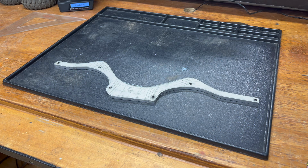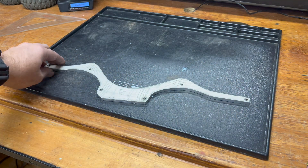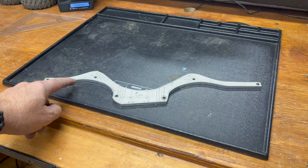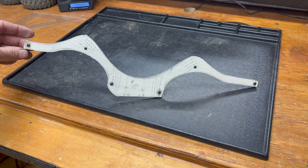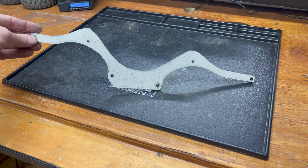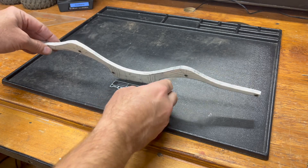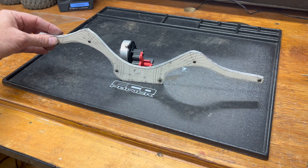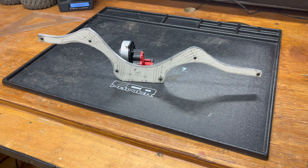The idea is to drill as few holes as possible — I went with six. I left the rail ends really over-long. It has a sort of photographic-image-of-the-Loch-Ness-Monster look to it. It has to go to the drill press now to get all the shock holes, link holes, and everything else drilled out — already marked and punched. The smooth curved cutout is equally easy as the super-angular design I used on Blue Sky High, and this time I shouldn't have to do any filing. With the gearbox visualized in place — skid there, gearbox there — yeah, that is really down there. We've really L'd the CG. Will it work? God, I hope so.